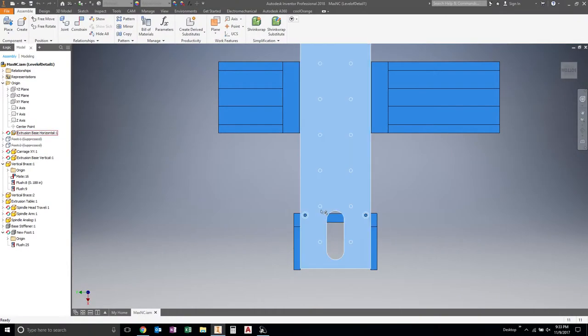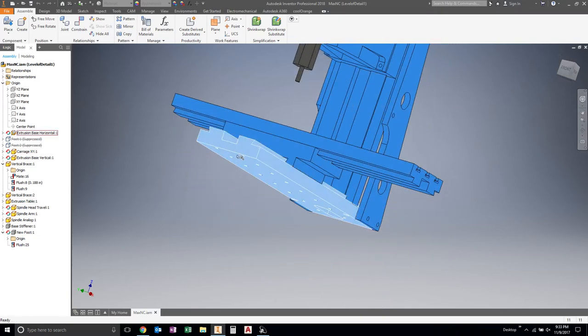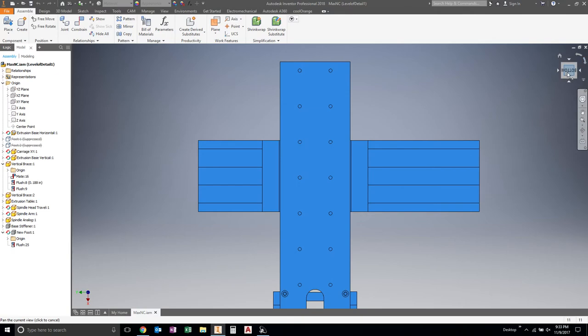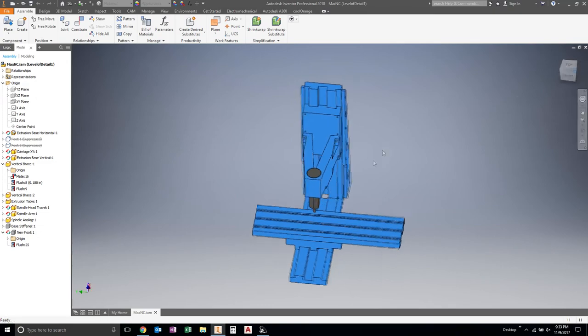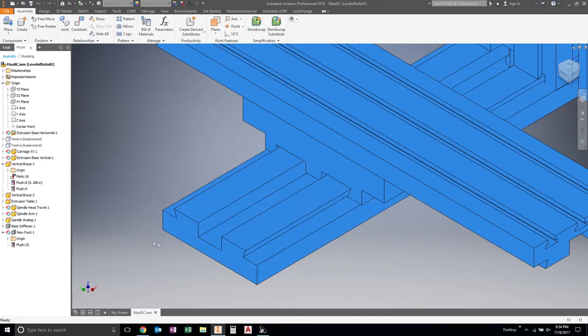Yeah. So I think we'll do a half inch deep, 1/4-20 hole every 2 inches. I think it's 7/8 from the center out to the hole. I'm a little nervous. I don't really like drilling and tapping into something without getting a better plan. But that's my thinking. Let me know what you think. Good idea, bad idea. Maybe a big flat piece of steel underneath here, 4 inches wide, the same width as this, or maybe 2 3-inch tubes.